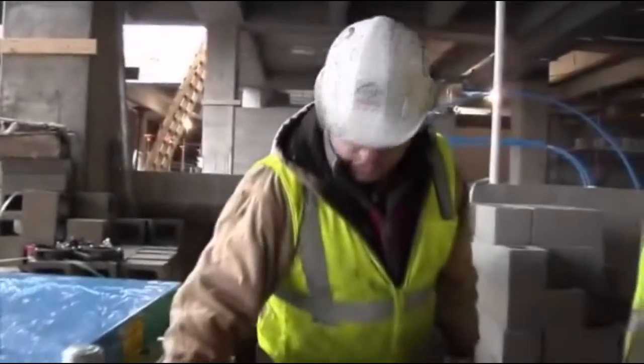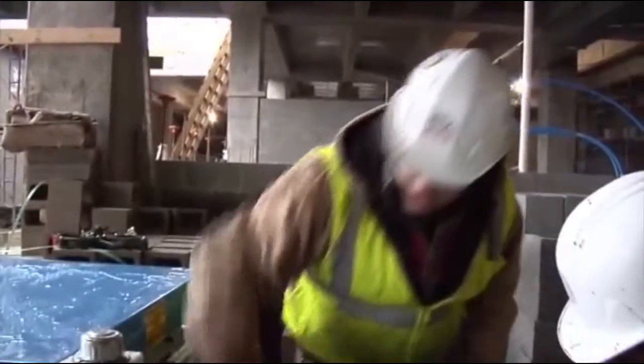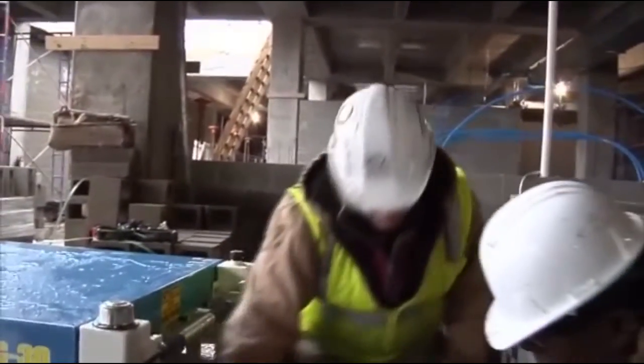These are the hydraulic levels. This is a good level here. When it's cold, if you just barely see it on here, this is fine because all of the hydraulic fluid is in the frame.